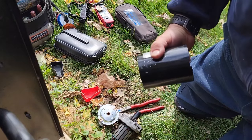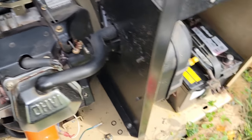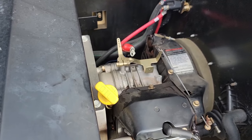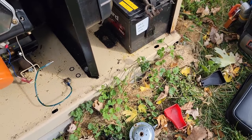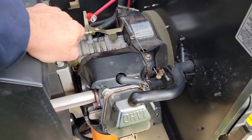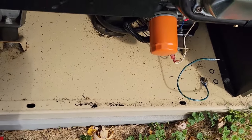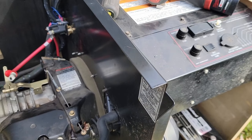I don't know how long it's going to take to get a replacement, so I may just go ahead and end the video here. As you can see, basic trial elimination is what we went through with the meters. You don't even need the amp meter - just your basic DC meter, making sure you've got power going to the starter. If it doesn't kick over, see if it's seized up, then give it a sniff with the old sniffer and see if she's a toasty critter. They didn't put an hour meter on back then, so you never really knew how much time you got out of it.